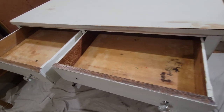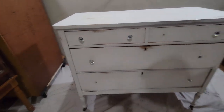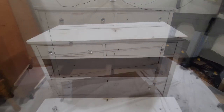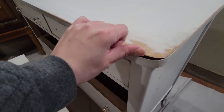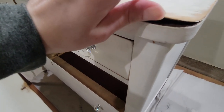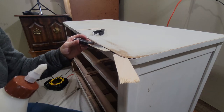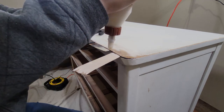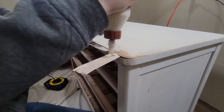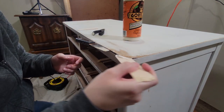The inside of the drawers definitely need a good sanding. Before we get started on anything, we're going to have to make some repairs because there is some peeling veneer on the top. At first I did try to fill this peeling veneer with the dresser upright using some Gorilla Wood Glue, but gravity wasn't really working for me, so I decided to lay the dresser down flat so that the Gorilla Wood Glue would seep into the crack and get a really good bond, so hopefully there's no issues in the future.